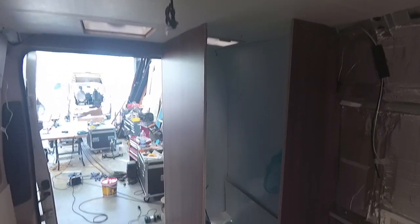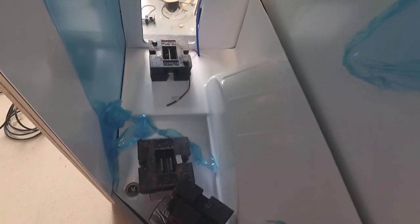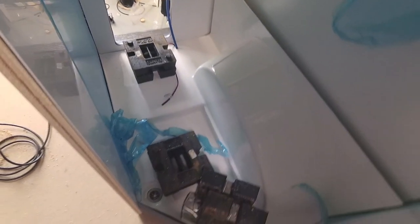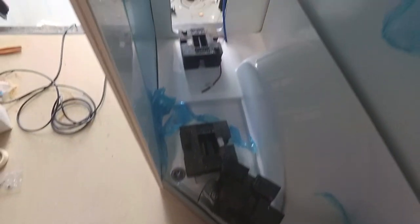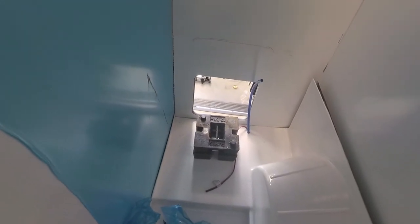The other two walls are cut in now and fitted. The little piece hanging across the bottom there is just sat in place at the moment, because I've got to trim the plastic down on both sides. The shower tray is a bit all over the place - it's warped as hell. So I've had to glue it down and put some weights on the bottom to let it dry overnight. Once it's dry this just pushes back no problem. The toilet sits in place - the water's through for it there along with the electrics. That tape mark on the wall is exactly where it goes so I can fit the bracket. Then it's just a case of siliconing around it.